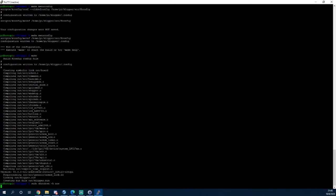Because we need to be able to determine which SKR is which, and in order to do that, we need to connect them, ping for a serial number with only one connected, put that into the appropriate config line, and then ping for the second serial number. So let me go get the Pi mounted and the SD cards installed and the whole thing powered up, and hopefully we don't burn everything to the ground.